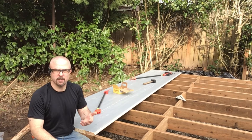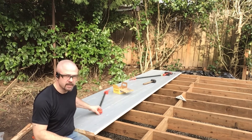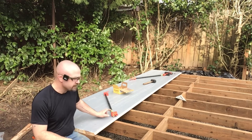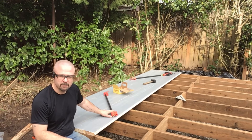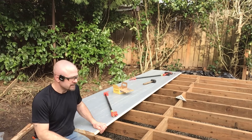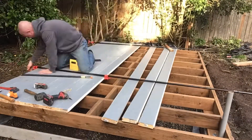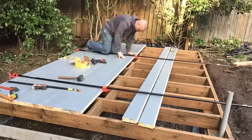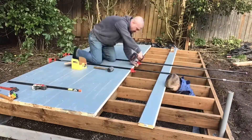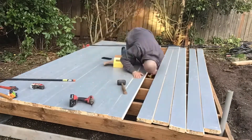These are kind of hard to get perfectly flush. I happened to use these pipe clamps — they're 36 inches of pipe, and that's not enough. I need to go to the store and get two 10-foot sticks so I can continue and finish up. Putting in this car decking took a lot more time and was a lot more work than it would have been to just throw down three sheets of tongue and groove plywood. I think it'll be worth it in the end to have a stronger floor and a stronger shed.